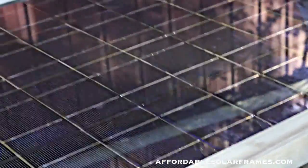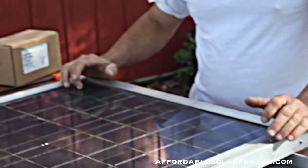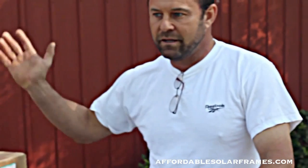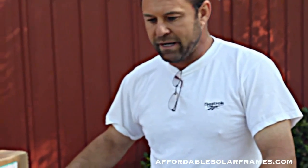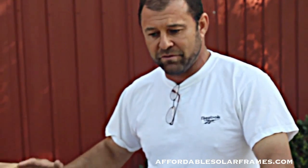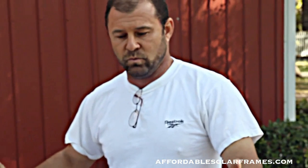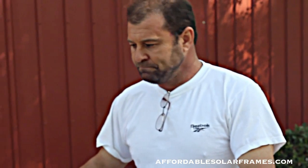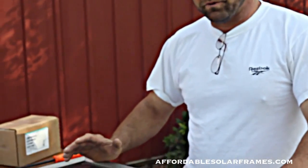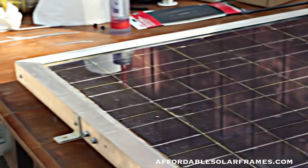The glass we use is clear tempered quarter-inch glass. A lot of solar panels you buy out there use just eighth-inch glass and they break easy — a 60-mile-an-hour gust of wind and it breaks, the frame's so weak it won't survive. Everything we're building is to last for 30 years, not just one summer. The glass has a 25-pound-per-square-foot snow load and a 100-mile-an-hour wind load rating.